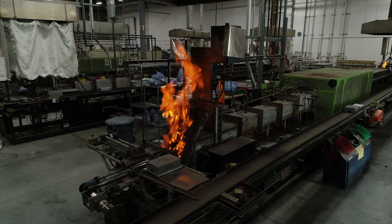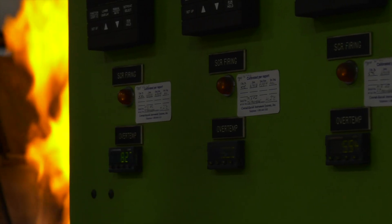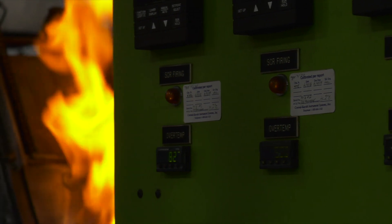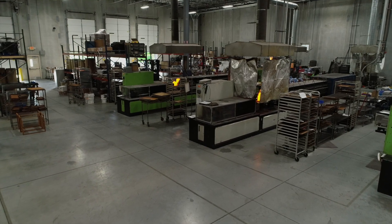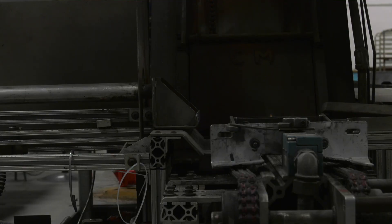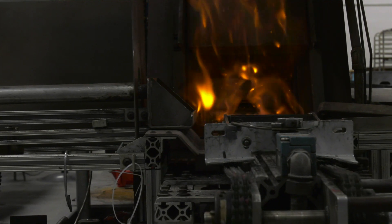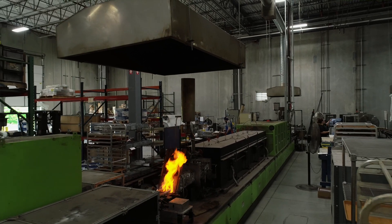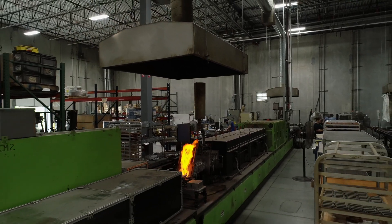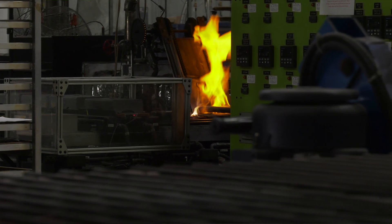After removing the moisture, we go into a sintering furnace running at around 1300 degrees Celsius for multiple hours to cause consolidation. In the green stage we have approximately 60 percent density, and we want to get to 95 to 98 percent density. Generally, we make product in the 98 percent density range because of the sintering process we're using.